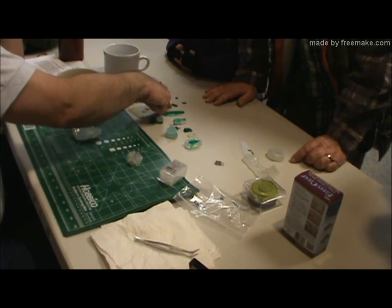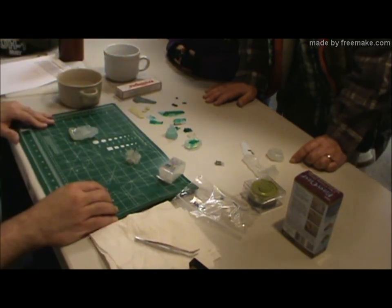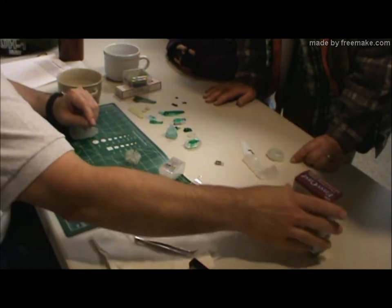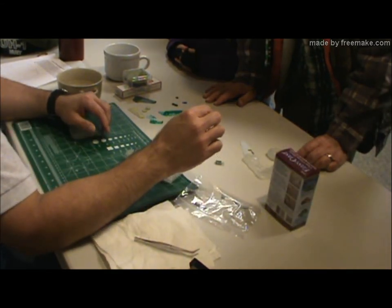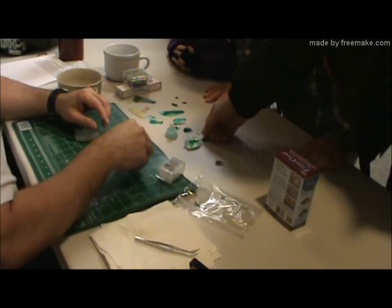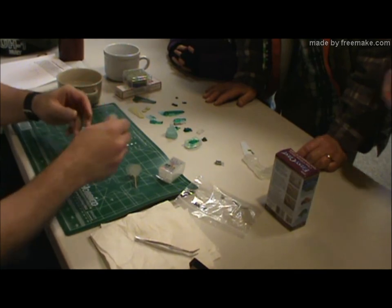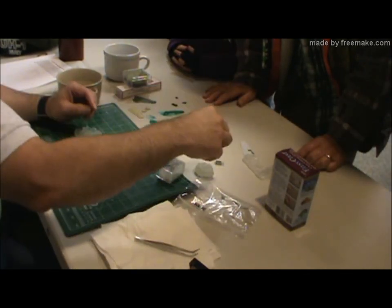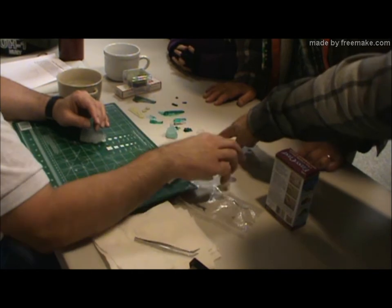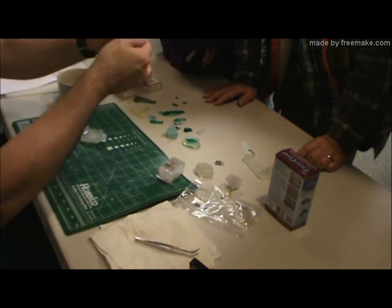This is like the Mediterranean tropical drop intakes from the ME-109. I tried those two materials and they didn't work too well. So then I bought some crystal clear resin. The problem is you make a top and a bottom: this is the bottom — still flexible — I just popped it right out. Here's the top. I wait a while before making the top so they don't stick together. This one I rushed and it stuck. You get flash in that hole — you use a drill to get it out. This was a test shot so it was sitting crooked and didn't come out great.